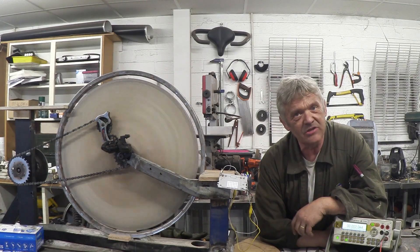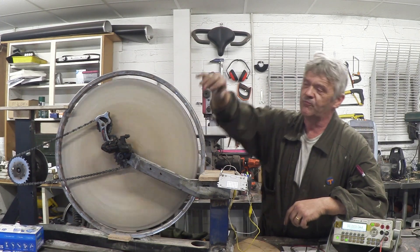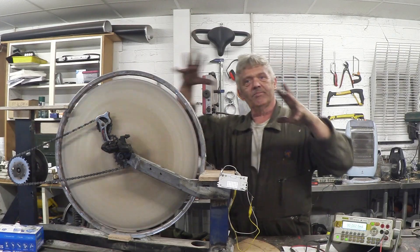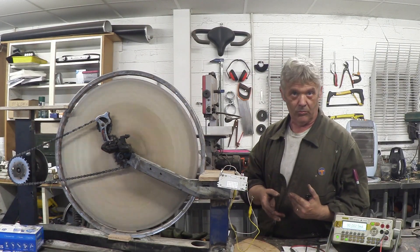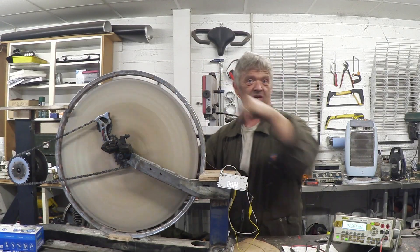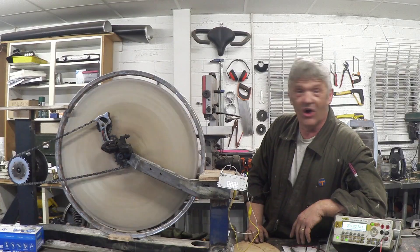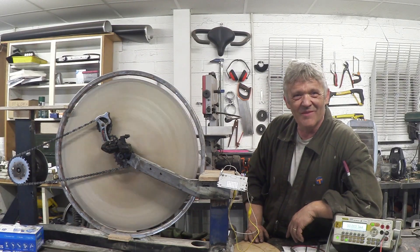What's really good about this is the coil arrangement — that's the really cool thing. The flywheel is great for energy storage but the coil arrangement works a treat. So make that big coil with the folded-over metal that we looked at in episodes 1119 and 1120, wind the magnets in half north half south, and you're going to have yourself a pretty impressive flywheel generator. Anyway, I wanted to share that with you because I finally got that done. I hope you enjoyed the video — please remember to subscribe and thank you very much for watching.